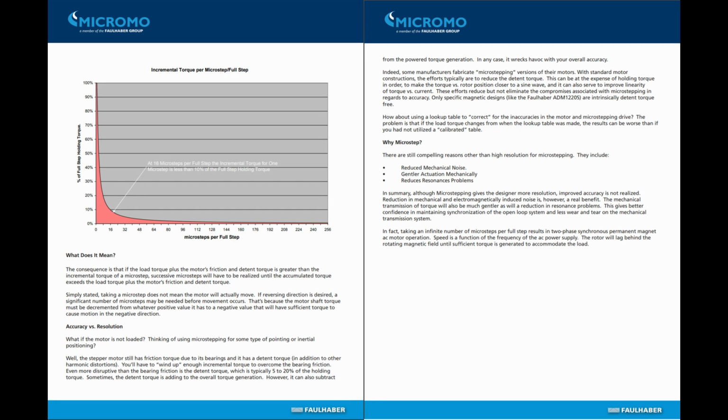The existing 1/16 stepping is 12.5 micron resolution on the belts. That works out to about 14 microns on the XY, depending on where you are on the build plate, in the center or the edge, which is already about an order of magnitude better than even a thinner Z-layer height. In other words, 1/16 stepping is probably the best setting to use anyway.